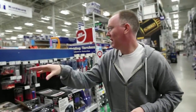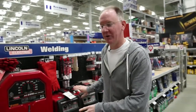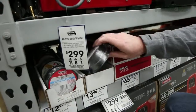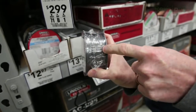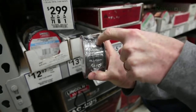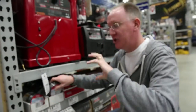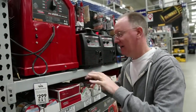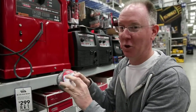We've got our helmet, our welder, and our gloves. We're also going to need welding rod — in this case, since we're doing MIG welding, we don't use sticks. We're going to use flux core wire. It's a thin silver cable and in the middle of the metal is flux, which is used for cleaning and shielding the metal — it acts like a shielding gas without having to have a big tank of gas. You're going to get 0.030 flux core wire to go with your welder.